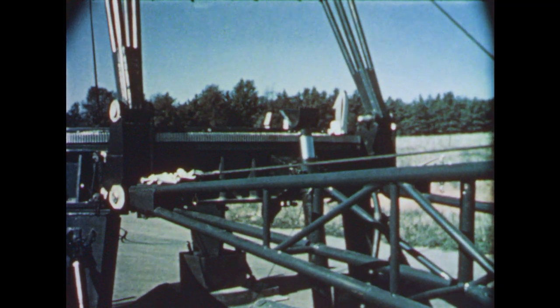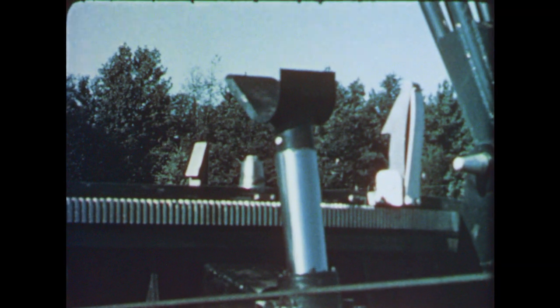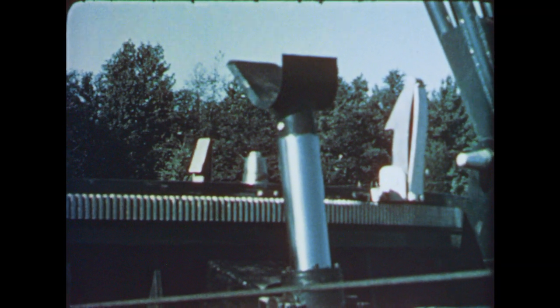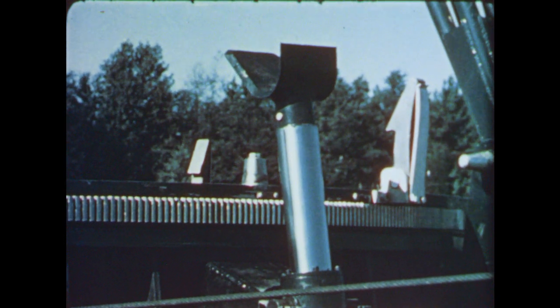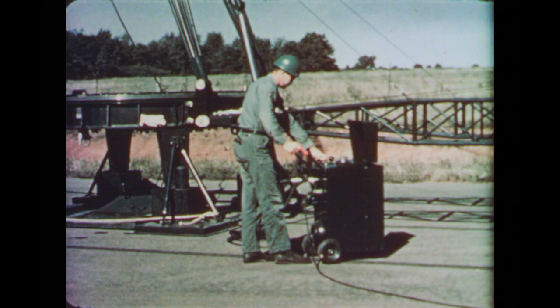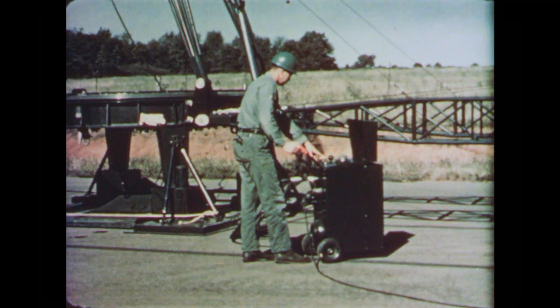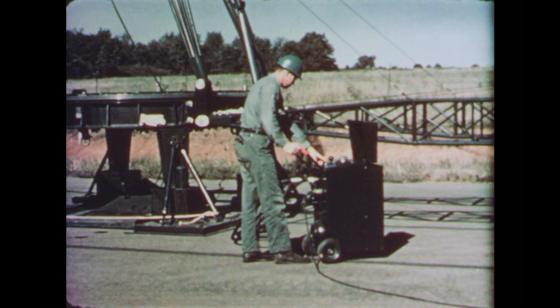Next, the raise-lower control is placed in the raised position and the forked cylinder ram begins to raise. Hydraulic pressure extends the ram. A bracket on the missile's auxiliary ring will engage the fork and slowly lower the missile. Panel controls are power switch, raise-lower flow control valve, pressure gauge and valve.